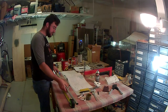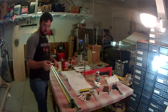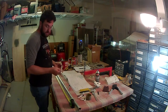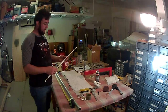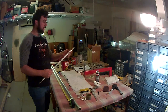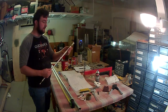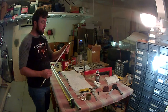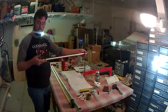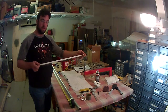It's a simple piece. The next piece you will work on is the actual rod that goes from the bell crank to the aileron, and ultimately it's going to look like this. This is a steel tube, half inch diameter. You basically line everything up with the rod ends, rivet everything in place to hold the rod ends together, and then put the rod bearings on the end. So this will attach to the bell crank and this end will attach to the aileron itself. As the bell crank moves it'll move the aileron.